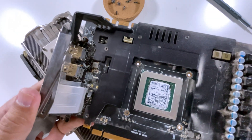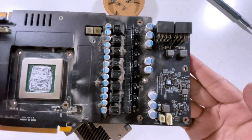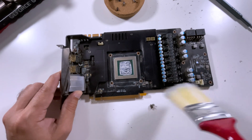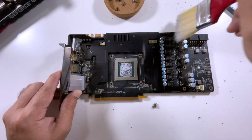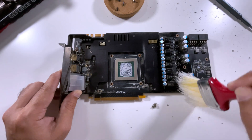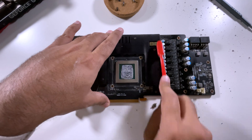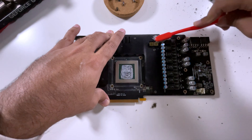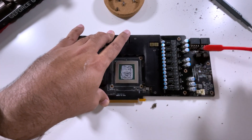You'll notice there is another heat sink for the VRAMs, but I don't have any plan to disturb it for now. The first step is to brush off any excess dirt as much as possible with a medium-strength brush. Don't use anything wet for now, as the dirt will stick to the components making it more difficult to clean from the PCB. Then use a smaller brush like a toothbrush to scrape off dirt from smaller corners of the PCB components — just be careful, as any hard stroke could damage the components or even the PCB print.